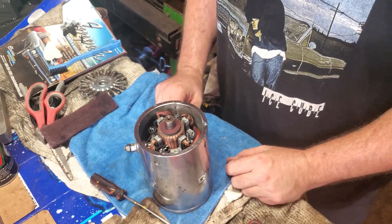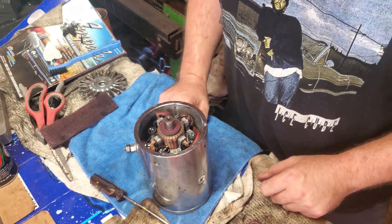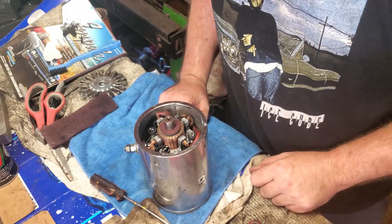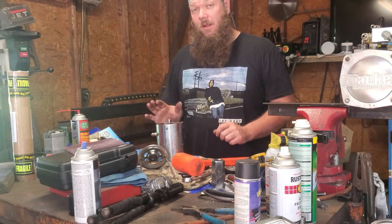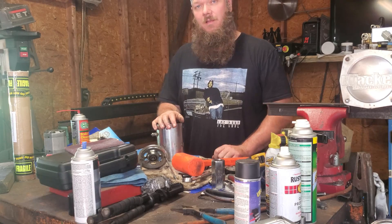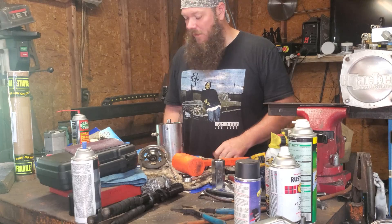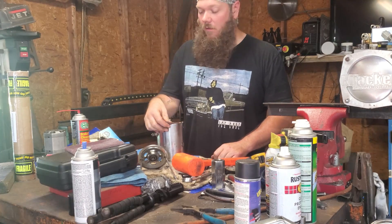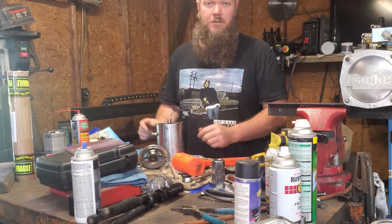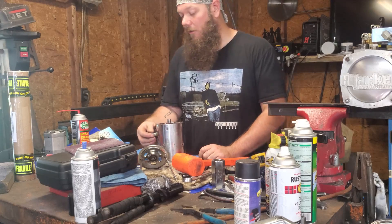That's it — let's put the motor together. It really isn't too bad. You just want to make sure that you're not damaging your brushes, because they are soft and they can chip up on the edge, and you want them in as best contact as you can get them. Hopefully that'll help you out as far as putting the motor back together. If it did, hit the like button. If you have a better way, leave a comment — I'm always down for finding easier ways to do stuff. Share the video so other people can figure out how to do this kind of stuff.